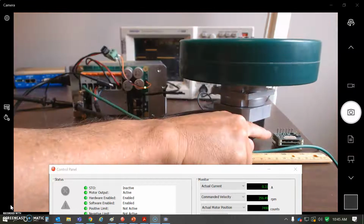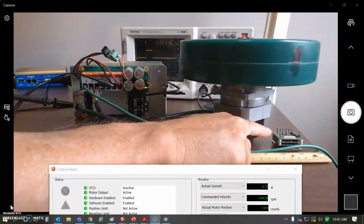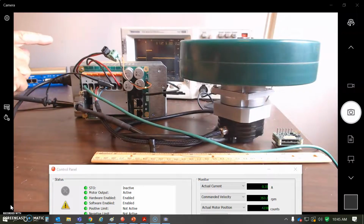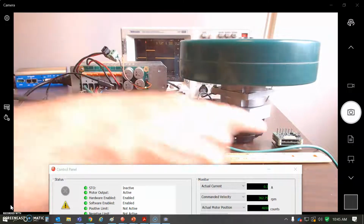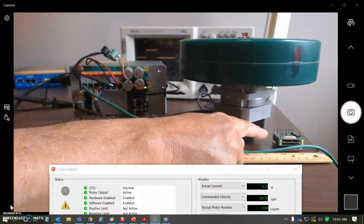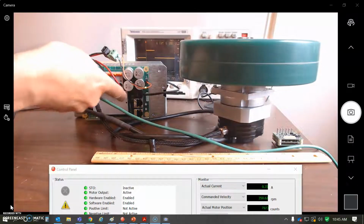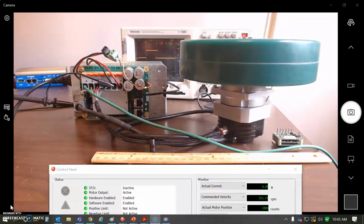Maybe in the future I'll run this thing with the Nano, or try to get an integrated thing closer to the motor, but this will do 70 amps peak, 35 amps continuous, where this is a 50 amp continuous. No heat sink right now. It's just warm, delivering several amps, but you can mount that to the plate or the frame of the AGV.